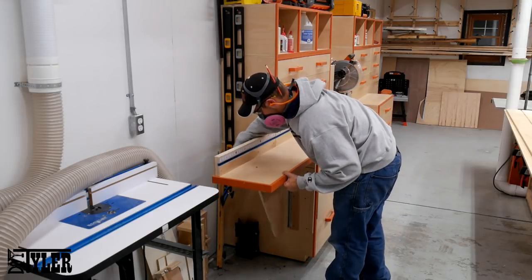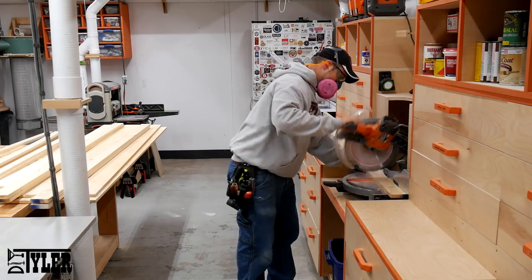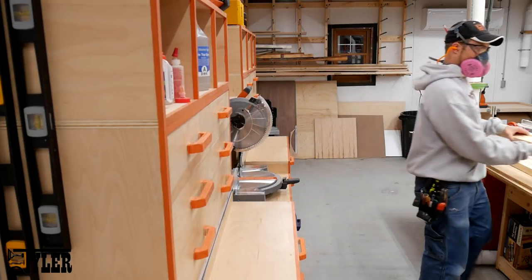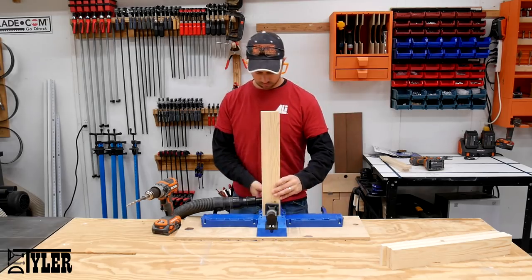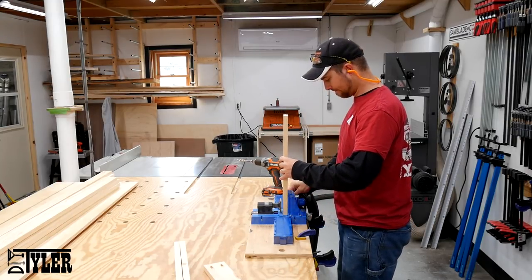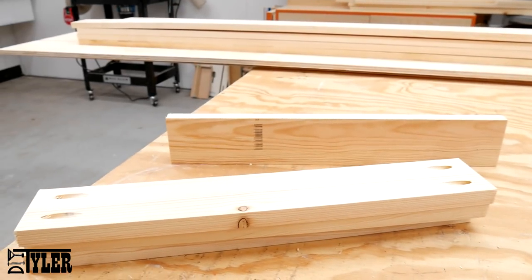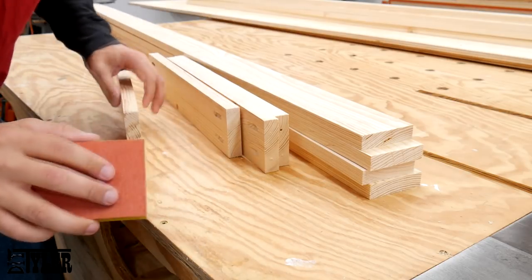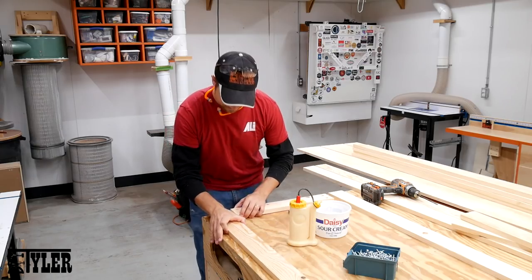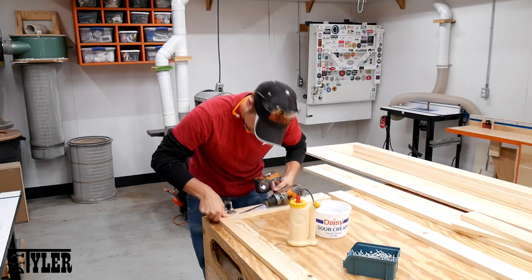Using the full capacity of my folding wing miter saw station, I cut those boards to the proper length. The frame is joined together with pocket holes and one and a quarter inch pocket screws. Being sure to keep everything square, I used coarse one and a quarter inch pocket screws and wood glue to assemble the frames.